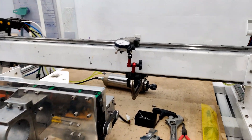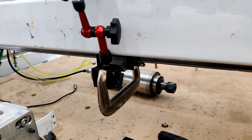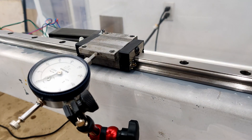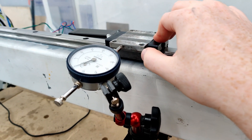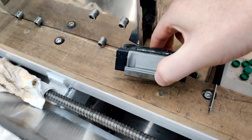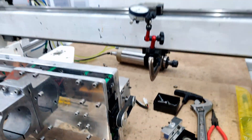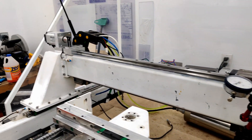This is a good way to do it. You'll want to get a dial indicator attached on one side — I'm using the bottom side. If you have your carriages mounted so the machine surface is accessible — these are probably cheap ones but they have a machine surface on one side, and on the other side there is nothing. So if you're assembling one of these machines, put the machine surfaces on the front sides and it'll make your life easier.